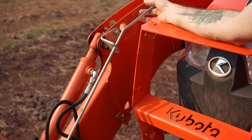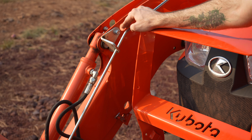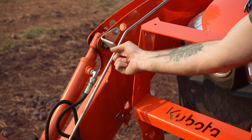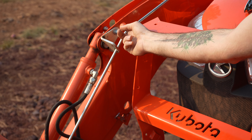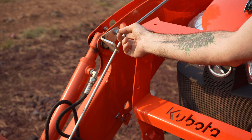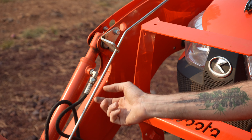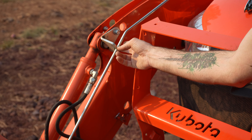Another thing I want to mention on the front of this tractor is this little bar right here that's all loosey-goosey. This is a low level indicator — when this piece gets to the notch right here and sits in the center, it means the bucket is completely level. This has been very helpful to see where the bucket is when I'm back dragging or trying to get dirt into the bucket and make good scoops. That is adjustable obviously.